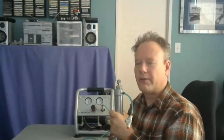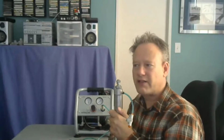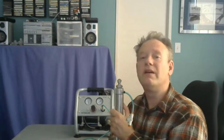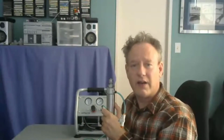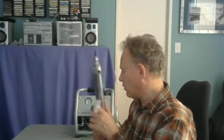I keep calling it throttling because in this case we're using a motor, and only a one-directional motor, so we're actually throttling. We're not doing metering. Let me say it this way: we're metering by throttling only. Now, a meter valve has a check valve in parallel with it to allow for the opposite direction, right? So let me just go over here.